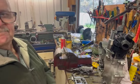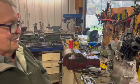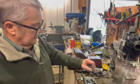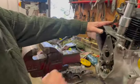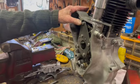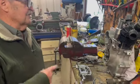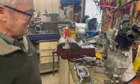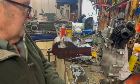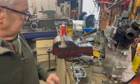Well, we did have one that had an extra tooth, didn't we, on the 500? Yeah, it was gaining time. That was an early one. It was until the valve hit the piston. Luckily, we were only winding it over by hand. But that came about because the crankshaft pinion down the bottom here, the little one, they made those in a few different sizes. The very, very early ones had an extra tooth or two teeth, and of course, as we were winding it over, the timing's getting worse and worse. I had never actually seen one of those pinions with the extra tooth on it, but I found one by accident. I hope you marked it or got rid of it. I've got rid of it, and I know what it looks like.